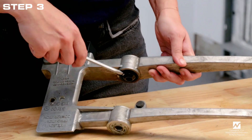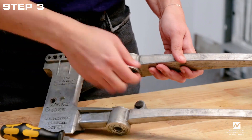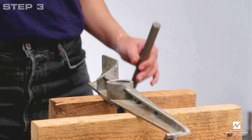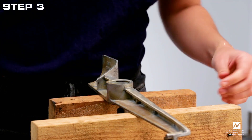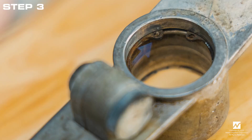Step 3: Remove the seals and bearings from the drive arm. Starting with the left drive arm hub, remove the cone spacer and use finger pressure to push out the ball bearing. If finger pressure will not remove the bearings, use a screwdriver and hammer to lightly tap the bearings out. Support the drive arm using wood blocks and push the seal out of the hub with a screwdriver or punch and the hammer. CAUTION: The bore of the right drive arm bearing hub contains a retaining ring located between the seal and ball bearing. The seal and bearing must be removed in the correct direction or else you will damage the drive arm hub.